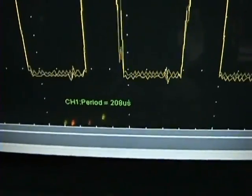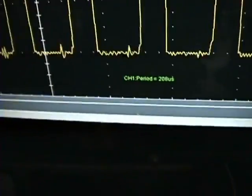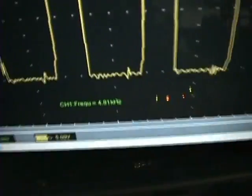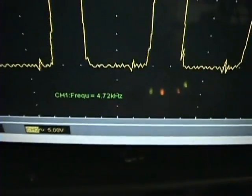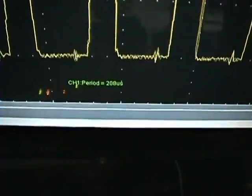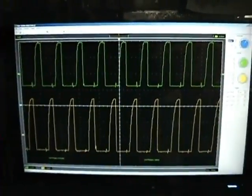Let's take the bigger neo out and put the quarter-inch neosphere in and let her rip. That's pretty fast. For those who are confused — there's my period: 208 microseconds, from this point to this point, which is one revolution. My frequency is 4.81 kilohertz. So now there's no doubt about the frequency, and you can calculate RPM from frequency a lot easier than from timing.